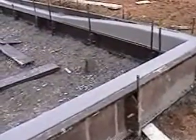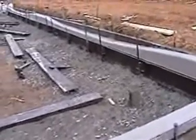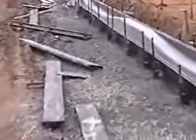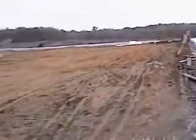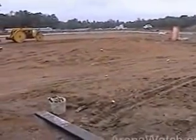The curbing that we used here is a 4,000 PSI mix. It doesn't have fiber mesh in, nor does it have rebar in it. Typically state jobs will dictate that, but for commercial applications it's really not required. It adds cost to the project, and the curbing is something that's put in because local ordinances and codes dictate that there has to be a curbing around the parking lot. It certainly doesn't help the bottom line in any fashion.